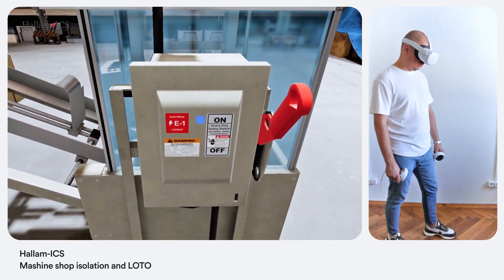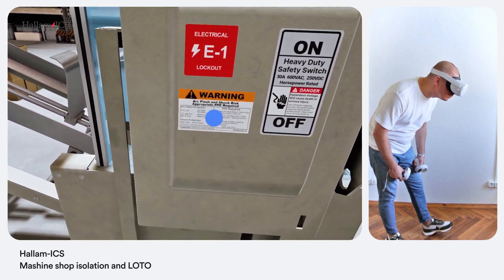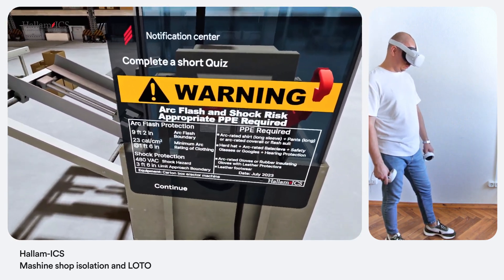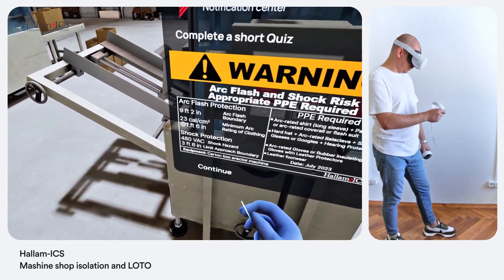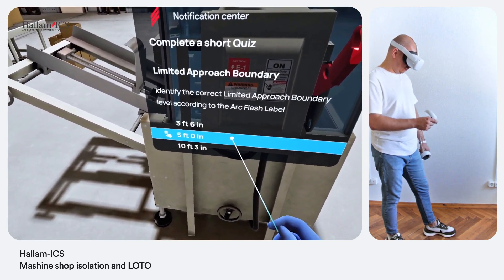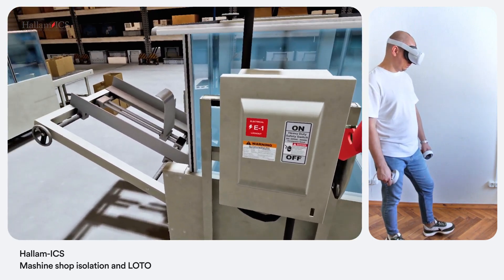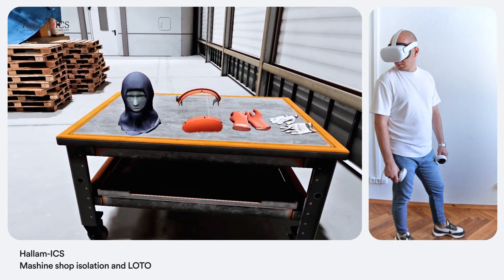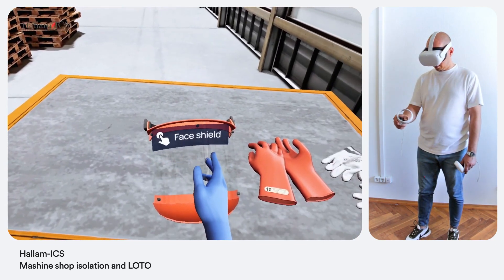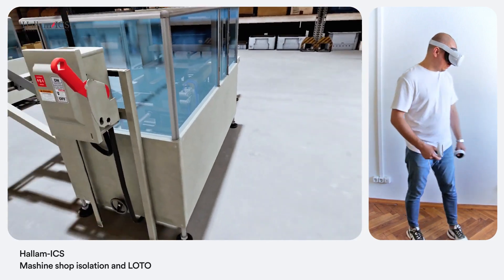Found the main safety switch. Good. Now let's take a minute to read the arc flash warning label on the main safety switch — I want you to identify the values on the label in the category of PPE required. Values identified and PPE category noted. All right, get your PPE on before proceeding — you'll need a balaclava, face shield, dielectric gloves, and leather protectors. PPE is on and ready to go.